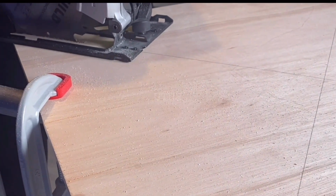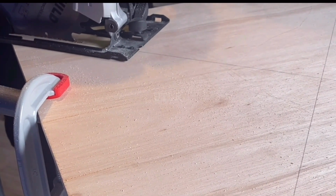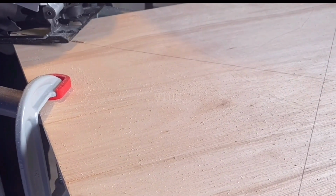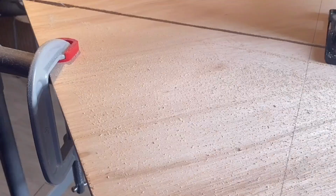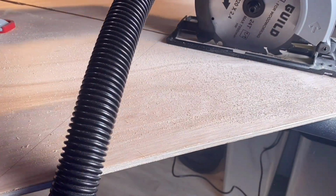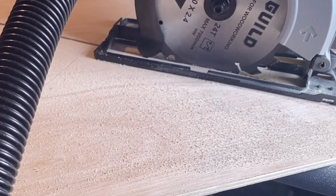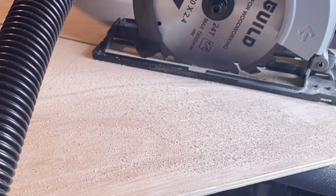After which, you can reposition the working tool along its line of travel or linear travel, okay, ensuring that the blade doesn't rest on the wood and it's free spinning, whilst you're trying to retrace its line of travel. You can start at the very initial position where you started making your diagonal cuts, or you can start off at the position where the saw blade stalled, but if you're experiencing difficulties from the stalled position, you can start from the initial position and retrace your line of travel all the way through whilst making your diagonal cuts.